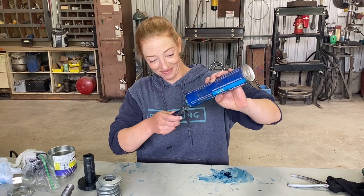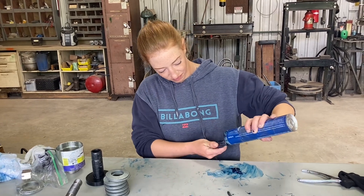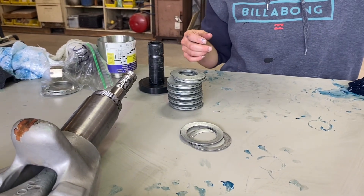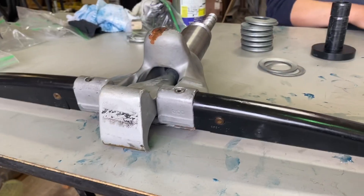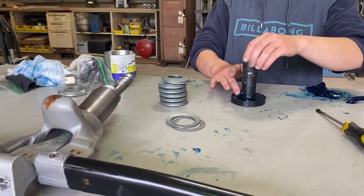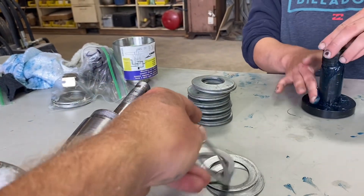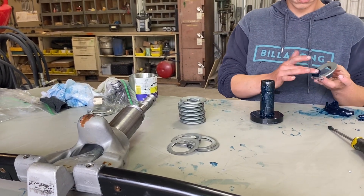We passed all of our NDT with flying colors, and now it's the fun of putting all these back together. Gabby's just scooping out some EP2 grease and we're going to be putting these spring packs back together with a nice layer of grease on them to prevent corrosion. Now that we have fancy new Fama grips, we won't have to have these apart for another couple of years, so we want to make sure we're preventing as much rust as we can. Here we have the sway dampeners — they all get covered as well.